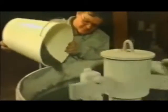Water is added to the dry powder in the mixer. It is advisable to start by adding only the quantity of water which is stated as the minimum. If more water then seems to be required to achieve the best consistency for the job in hand, extra water can be added up to the maximum permitted quantity. After about 10 minutes mixing, the exact time depends on the efficiency of the mixer, steel fibres are added. The normal dosage is 1.8 kilograms per 40 kilograms of Densit. Mixing is then continued for 3 to 4 minutes and the material is ready for use.